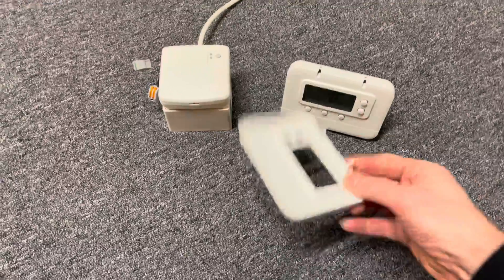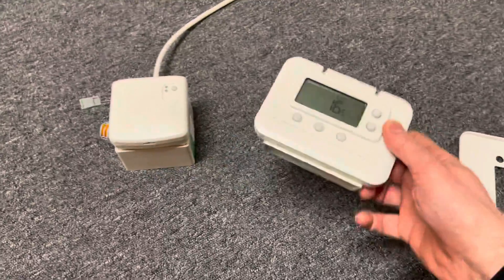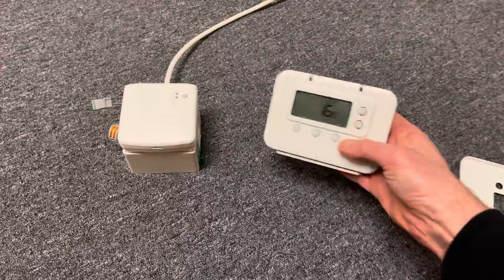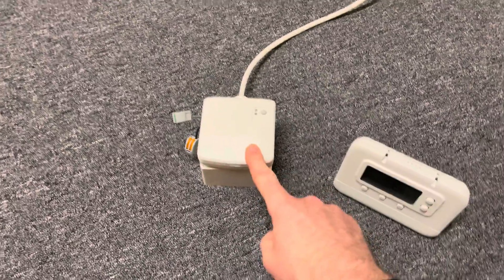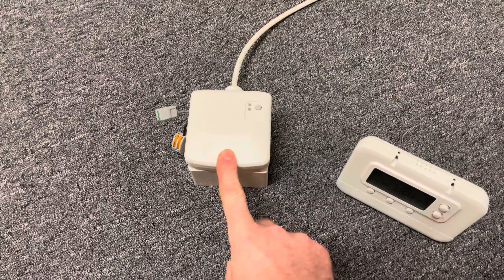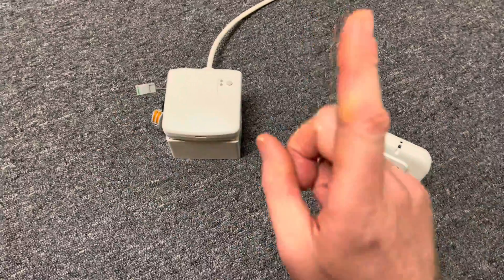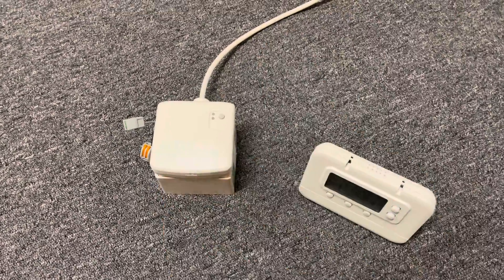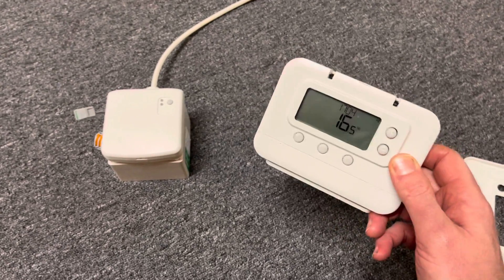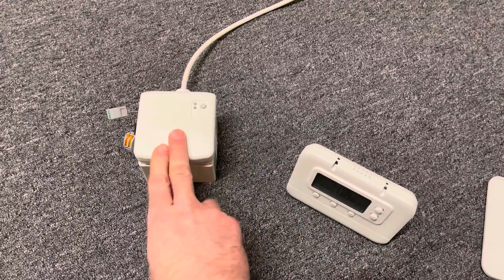I've taken the front cover off the Pro Series thermostat just for clarity. If you're having issues with your Pro Series thermostat and it's losing its communications with the relay box, it's normally because the relay box isn't a BDR91. Some of the older Honeywell wireless relay boxes were what we call a HC60NG, which was a rectangular relay box. The problem with those relay boxes is they were a one-way communication device, and this is a two-way communication device, so you're going to have some issues. My advice is if you've got one of them, you need to swap over to a BDR91.